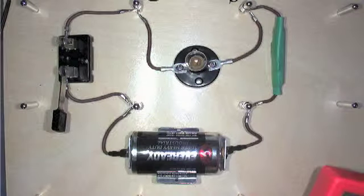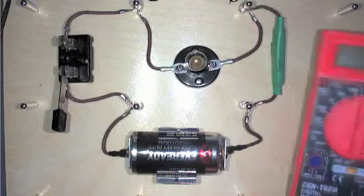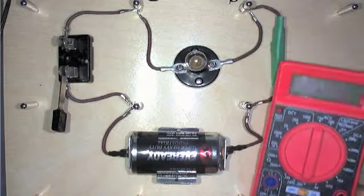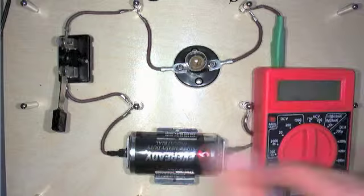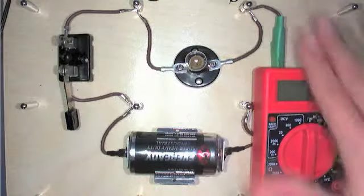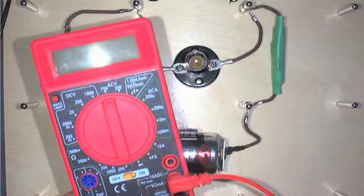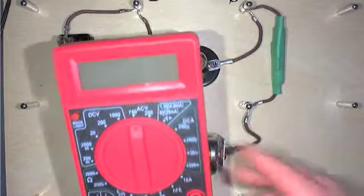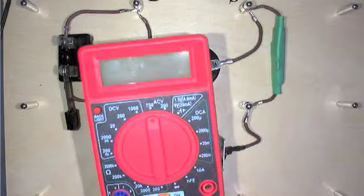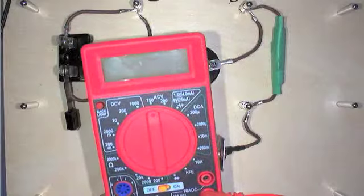We're going to talk about how to measure resistance with our multimeter. And this time you'll notice with our simple series circuit, our switch is open, okay? So our circuit's connected, our switch is open. Our black lead is in the bottom on our multimeter, and our red lead is where the omega sign is, okay? So you know your answer is going to be in ohms.